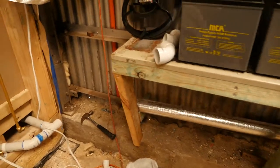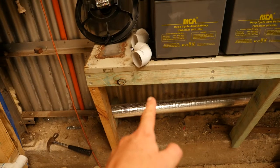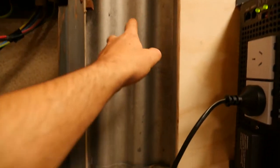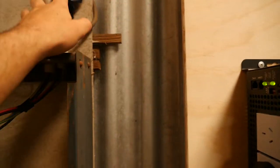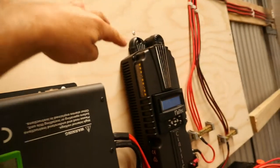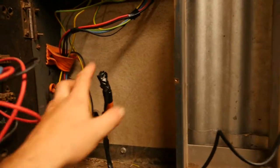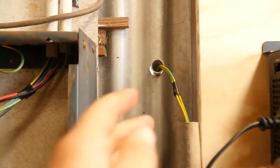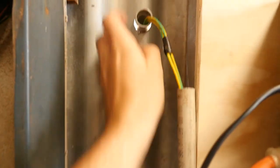I've got the earth wire connected into the ground, which is sitting out there on the outside. I wanted to come in about there so I can put some conduit coming out and have it come along onto an earth bus bar, and then also connect up to the fuse box. So I ran the earth wire through the conduit on the outside and poked it in here — that's it coming out.